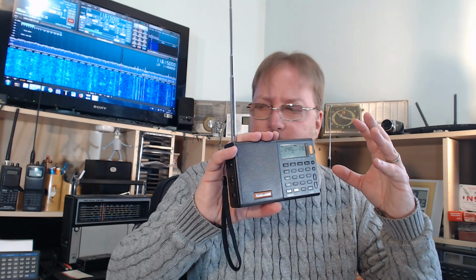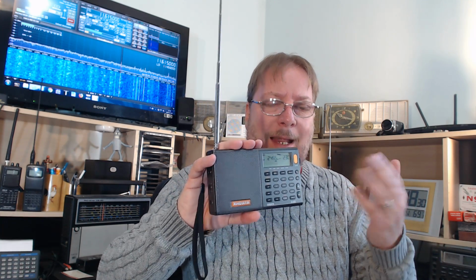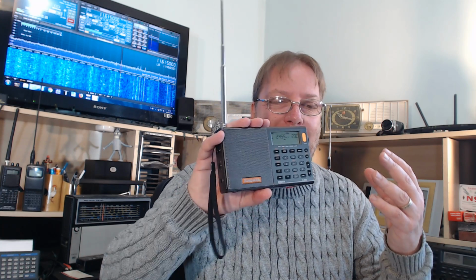Another annoying thing, the AGC is struggling very often. It especially shows on the single sideband mode, where you have chuffing and you have this kind of rise in noise, and then for maybe a second it mutes a little bit, not mutes the audio, but if you're listening to a single sideband signal or an amateur radio signal, it actually sometimes will kind of block that reception a little bit. Then whoop, it comes back to normal.